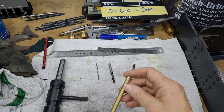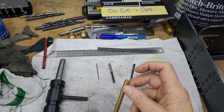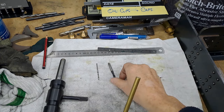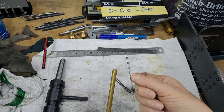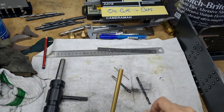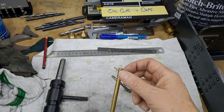And then when we've got 10 of those, we'll flip them around, put them back in the collet chuck. We're then going to be drilling down 14mm. We have the 5.2 drill, so we can tap M6, and then we're going to drill that last little bit out with a 3/32 drill. Wonderful. Good job. I have an imperial set of drills now.